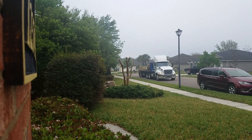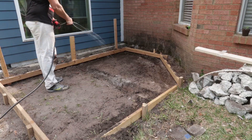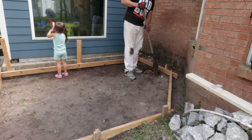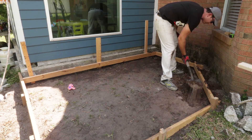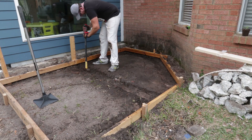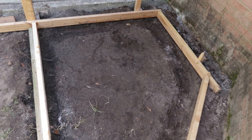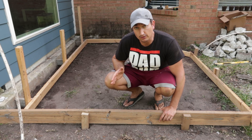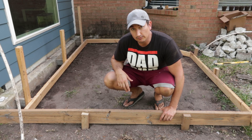Next, I'll get supplies to tamp and bed the concrete. I'll tamp all this down, get it nice and compact, and then I'll probably dig little ditches around the perimeter. Then I'm going to decide whether I can pour it all at once and mix all the bags myself, or whether I want to do this in two sections. We'll see what happens and go from there.